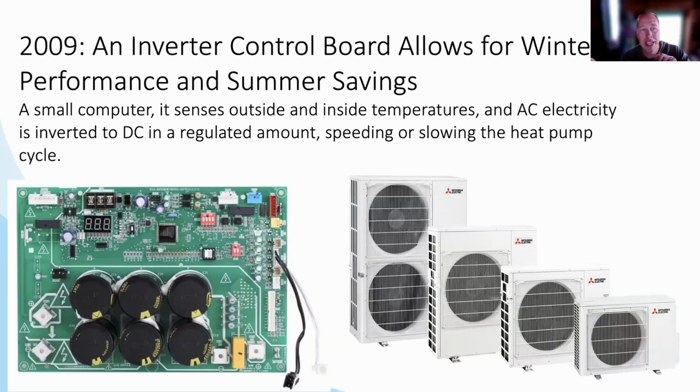And so you can constantly get the fan and the compressor working at the right speed for the temperature inside and outside. That's what it does. It makes it way more efficient, way quieter, because it allows you mostly to be running everything at lower than full blast. And it allows it to just sort of stay on as opposed to having to turn on and off. A lot of people don't like the sound of a furnace turning on and off in their house when they're warming the house in the wintertime. And this doesn't do that. This is just a low speed of fan and doesn't wake you up at night with the whole big noise experience.